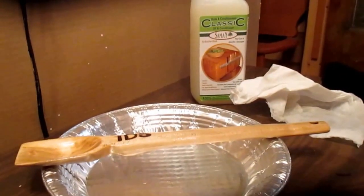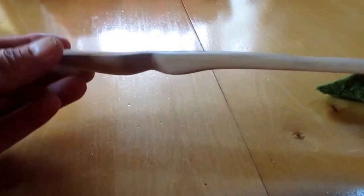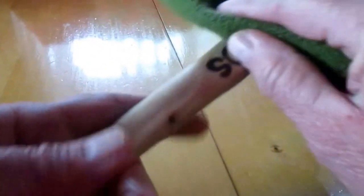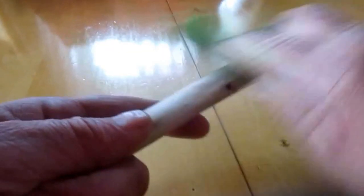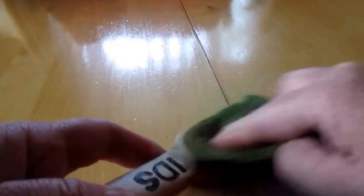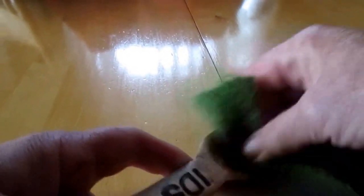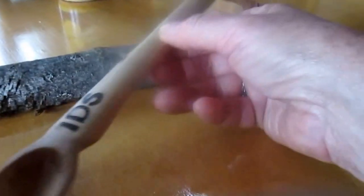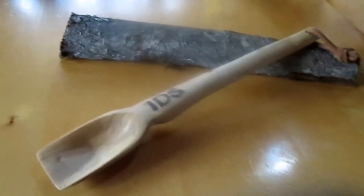I set it down to let it dry. The oil has penetrated well into the wood. To seal it — to seal the pores — I rub with a wool cloth until I feel it getting warm. At the same time, rubbing like that gives a slightly lustrous and very smooth finish. A leather strap for the finish, to hang on a carabiner or a tree branch. And here is how we went from that to this.